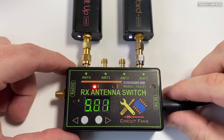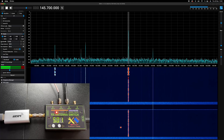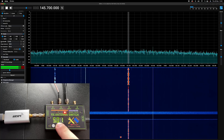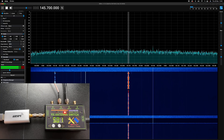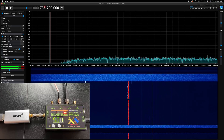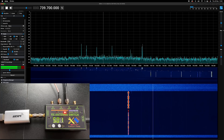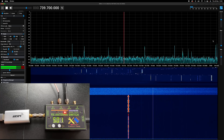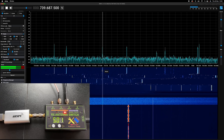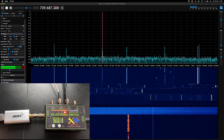The specifications for this antenna switch state a supported frequency range of 300 kHz up to 150 MHz. Here I have my dual-band co-linear attached to port 3, and on port 2 I have the output from an LNB which has an IF of around 740 MHz — outside the supported frequency range. When I switch to port 2, I'm still able to receive the 740 MHz IF from the LNB, though the signal looks a little attenuated, it can still be used.